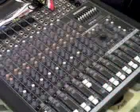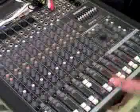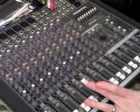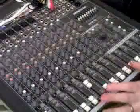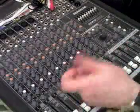So if this isn't loud enough, then you use your amp to increase the volume of the front of house speakers. This just gives you fine tuning from the desk to boost that signal slightly and equally with the main mix. But this should not be thought of as an amp. Your amp is a separate component or part of your active speaker. So they come with a volume level on them.